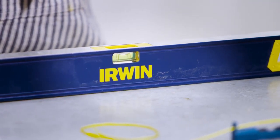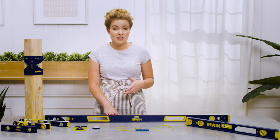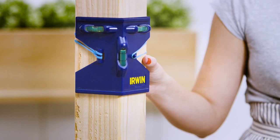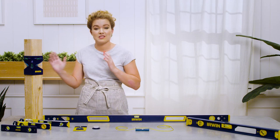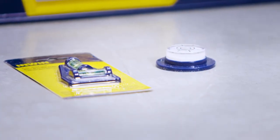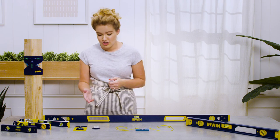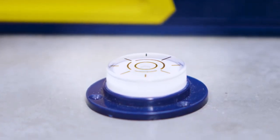The box beam and the I-beam look a lot alike and are pretty similar. The box beam is sturdier, more durable, and less likely to become inaccurate, while the I-beam is lighter weight and more affordable. The post level is a unique level for unique scenarios — it's great for setting posts and checking for plumb in multiple directions at the same time. Lastly, the cross-check level and the bullseye level are more unique levels designed to sit on a flat surface and check for level in either two different directions or all directions at the same time.